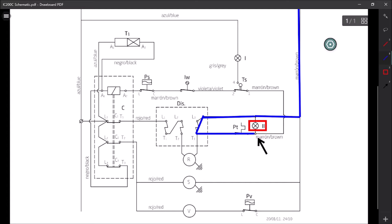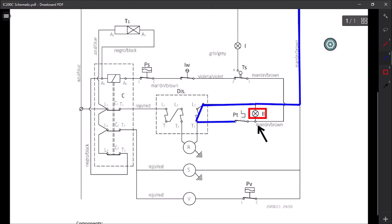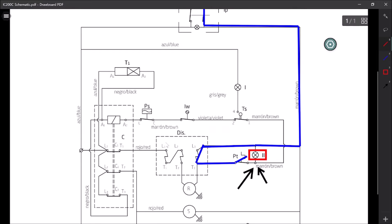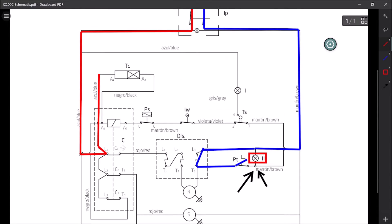But if you look more carefully, we come through to PT, which is motor thermal protection. If this is open, we're not getting power to this side. At first glance it looks like we'd never get power to this light, but if we follow this backwards we're actually going to back-feed. We take our L1 through our switch, come to L1 on our contactor coil, which bumps up to T1 - our start timer - then through our timer contacts, and the A1 coil is going to be hot.